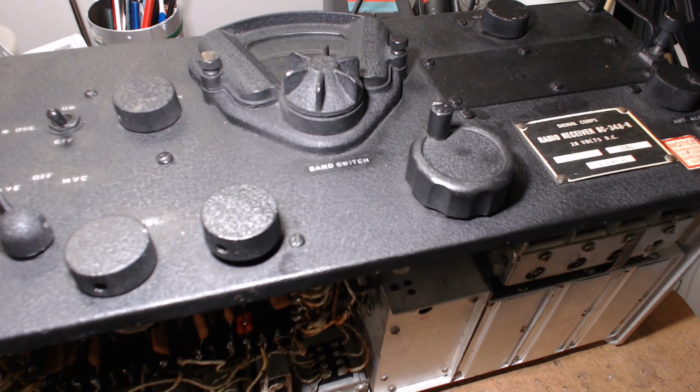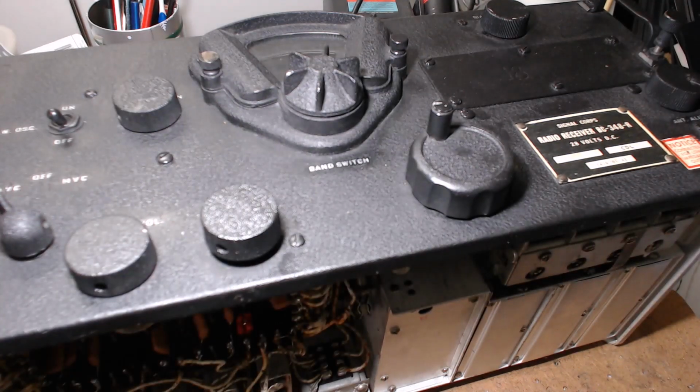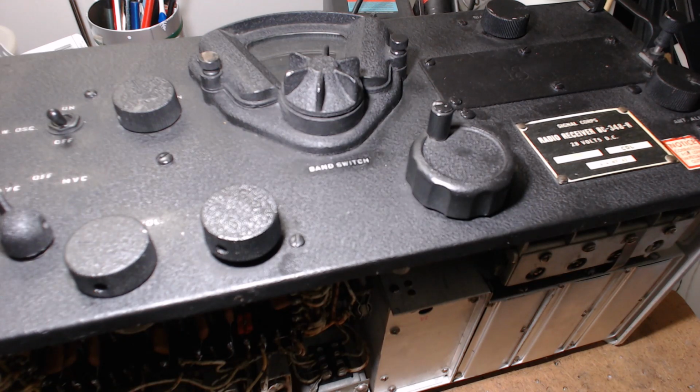Then you drop some penetrating oil down into the set screw and let it sit overnight. Also make sure your Allen key is brand new. You don't want to round over one of those set screws. Okay, very important. The other trick is you can stick a soldering iron in through the hole and heat up the set screw, and that might help you. But you have to have the oil on the set screw, so the moment it cracks loose, more lubricant goes down further on the set screw. So when you do get it loose, it will come out.